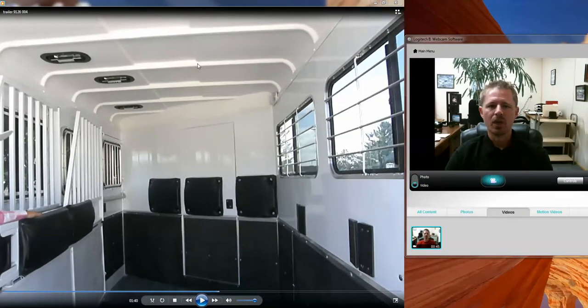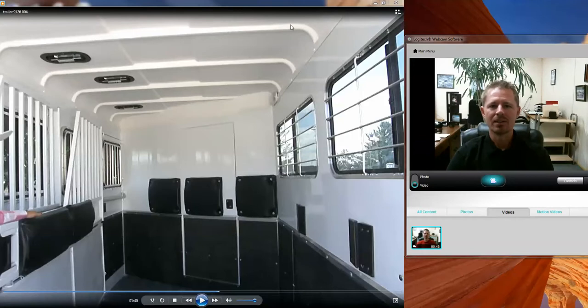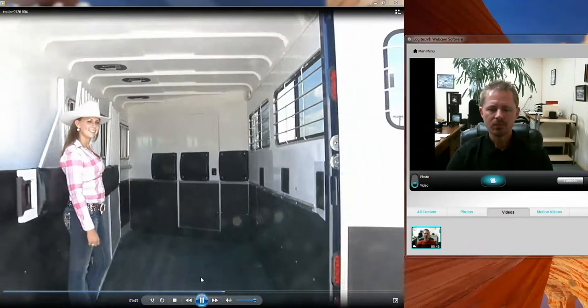On this Safe Bump roof you'll notice it has Z-frame dividers molded right into the roof. Our older Safe Bump roof had great appeal but in a rollover situation we didn't have quite enough structural supports, and it was assembled in panels every four feet — each seam being an opportunity for future leaks. Now this is a fiber composite roof, truly one piece molded with no seams whatsoever, so it cannot leak. It's self-insulating and white so it reflects heat — very cool for your horses. If a horse were to rear up between the structural supports it's very forgiving on the horse's head, maintaining the Safe Bump roof process. And of course there are vents throughout the roof.